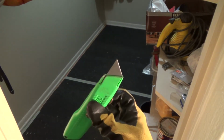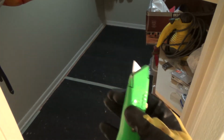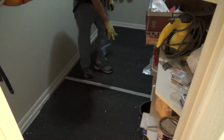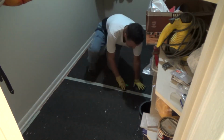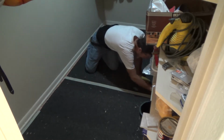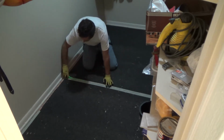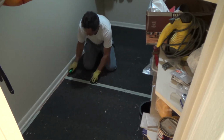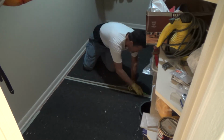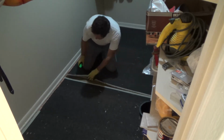That's how we're going to remove this carpet pad, and I can leave this halfway if I want, because the first thing I'm going to do is look where all of the taped lines are. Chances are all the seams have a line and it's connected and attached with a piece of masking tape or something. Score that, okay? Make sure it's up all the way like that, okay?